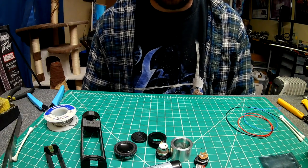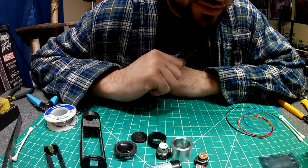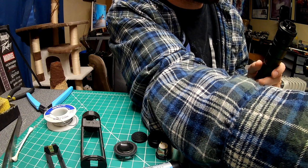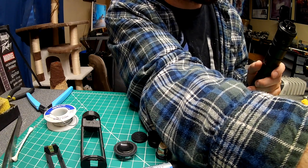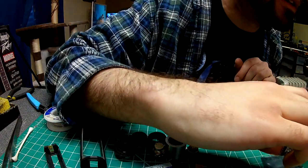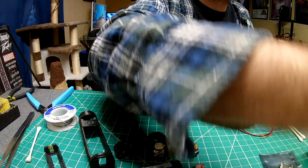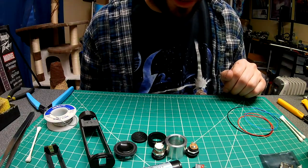One more thing you'll need is the manual for the board — that is very crucial. Since the last board I did was a tri-cree, I don't know where to land the data on this Verso, so let me check the wiring diagram real quick. Data is landing on the fourth pad down. As everybody always says: RTFM — read the freaking manual. I've been doing this for two years and I still have to do it. You'll never learn everything.